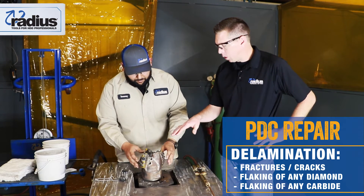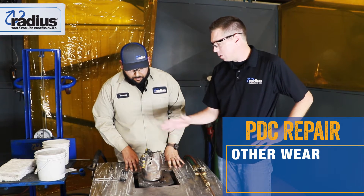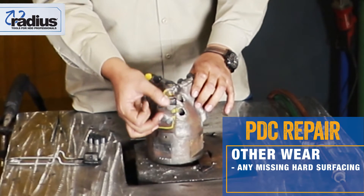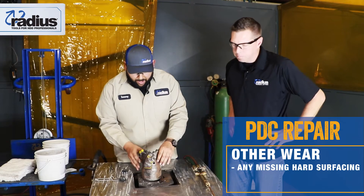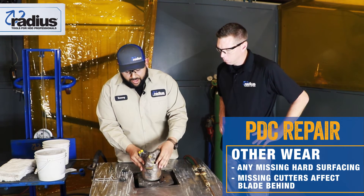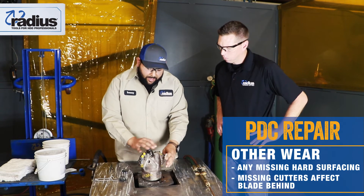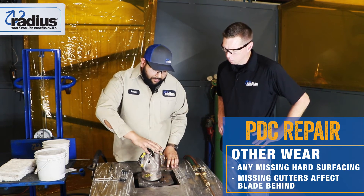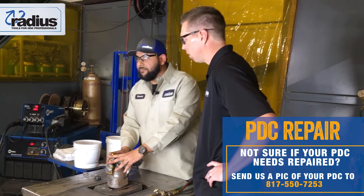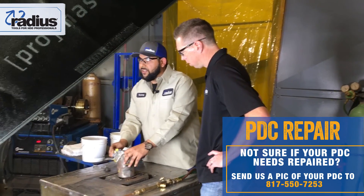Is there anything else you can look for behind the blade if you don't know what that's going to look like? Can you see any wear on your bit? Yes — any hard surfacing that you don't see there anymore, that would be a sign. And when any of these cutters come off, that wear will end up being on the blade behind it. So if anything starts cracking off or falling apart, that would end up damaging the blades behind it. So you want to bring it in, get it inspected, and look for any kind of rounds or wear flats on it.